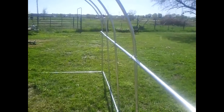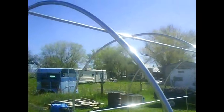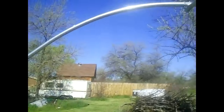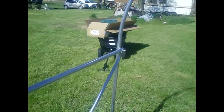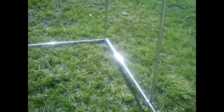The side rails go on the inside and the side braces go on the outside. Now it comes with two hoop pieces that go together. The easiest way I've found to put this together is to lay your first hoop down right on the ground. Put that first hoop together but don't bolt it at the top — you'll do that very last. Bolt your side pieces together and then put on these side support braces, and put your first hoop all together along with the bottom rails.